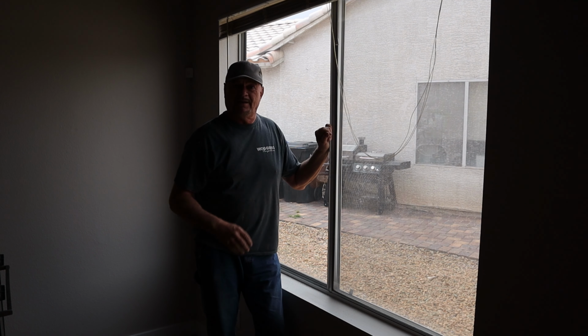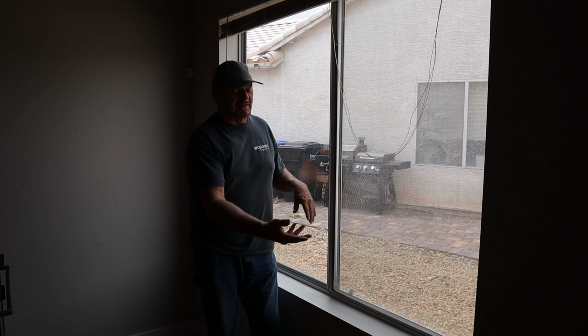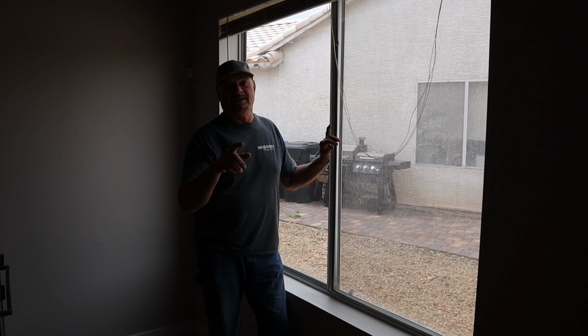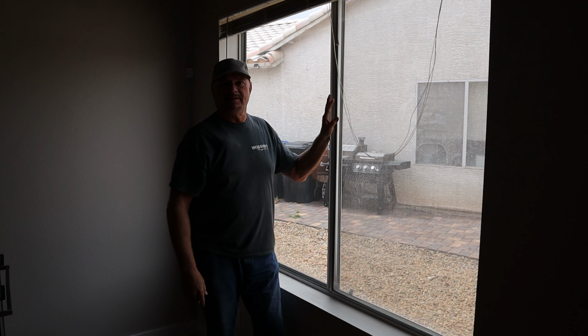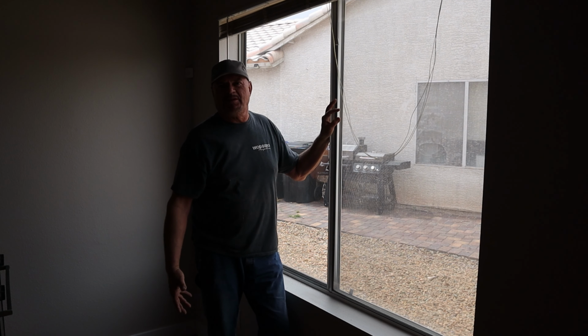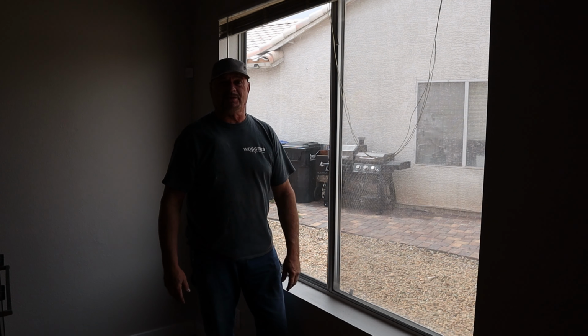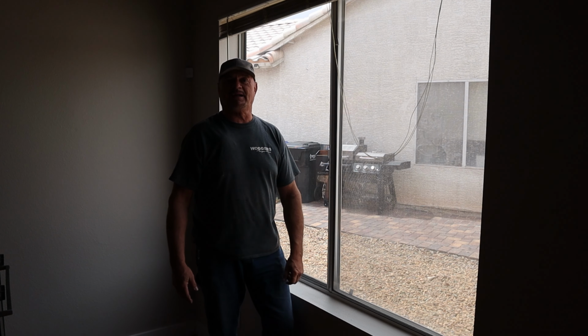So if you're doing this for a client, go ahead and clean the window, clean the tracks, clean the rollers, get it all cleaned up, because like I said, they might not notice that you did it, but they'll notice if you didn't. So, plus they'll be happy and they'll recommend you to somebody else. All right, I got some more to do, but that's all there is to it. Easy peasy. Take your window out, pull off a roller, match it up, throw it in, put your window back in, and you're done. And that is the Woggers way.